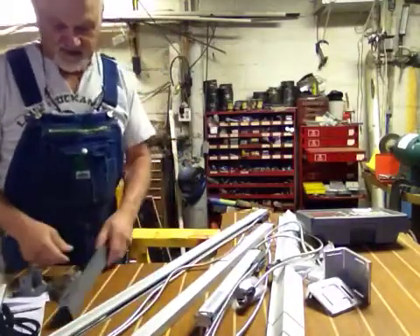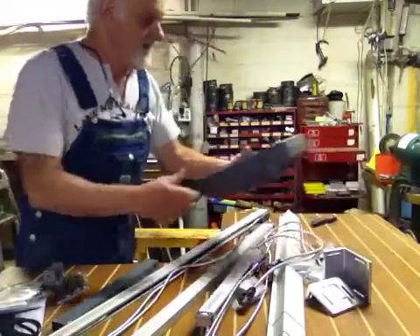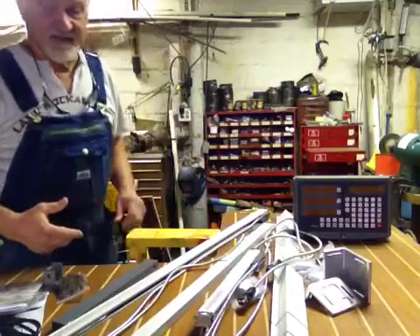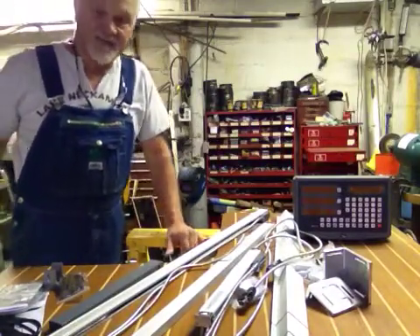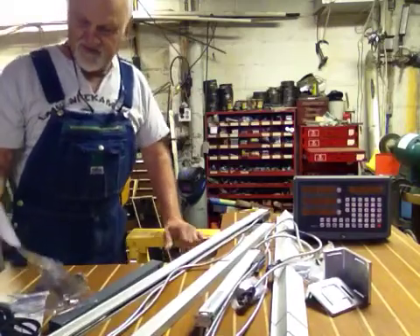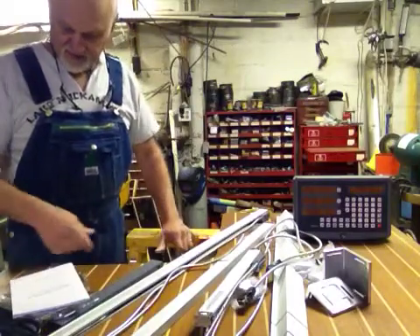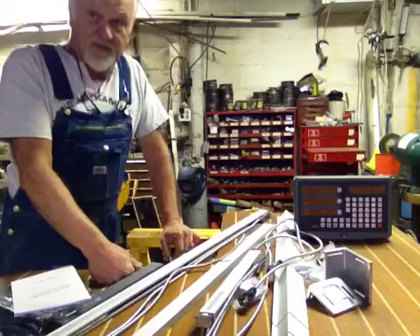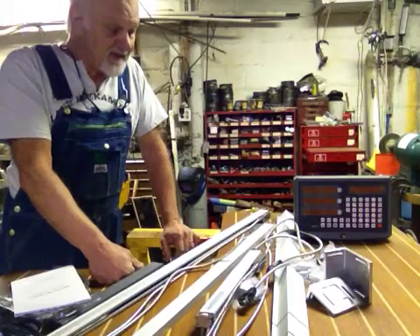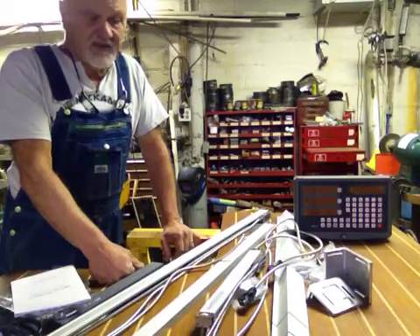Here it is — I'll do a close-up. That's the mounting bracket. I have to figure out where I'm going to mount it on the actual Bridgeport. I wanted you to see it before I actually started mounting it. So far I'm very happy with the electronics — it looks like decent quality. There's a booklet that tells you the functions, how to do the calculations. I don't know if it says instructions on mounting, but if you're a machinist and run a Bridgeport, you pretty much know how to mount it — that's not rocket science. The next step will be mounting the scales, mounting the display, and showing its operation.